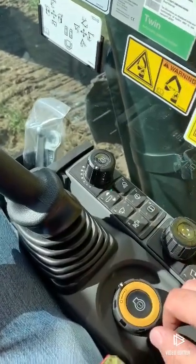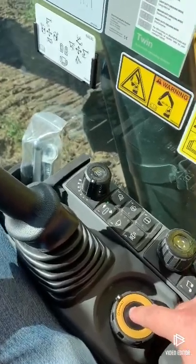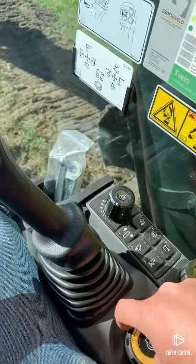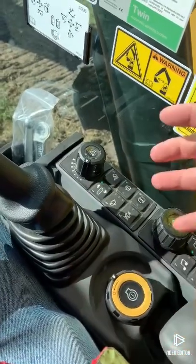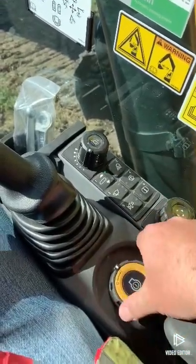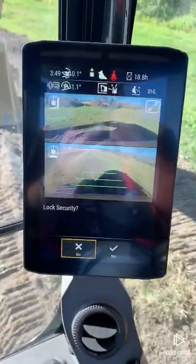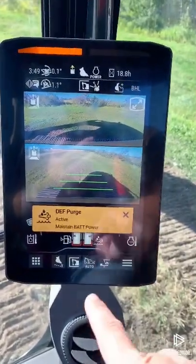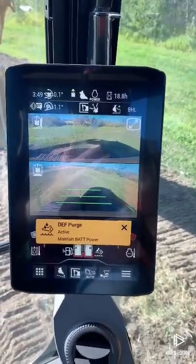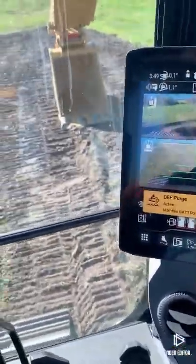One quick tidbit: when shutting down your new next-gen excavators, always make sure you press the push-to-start button to shut the engine off first — don't just jog the ignition dial. Press the button first, then once the engine has shut off, cycle your ignition switch. This machine has a security code, so we lock it out, and then you'll get a DEF purge warning showing up. Make sure you don't kill the master disconnect switch until the DEF purge light goes out on the back of the machine.